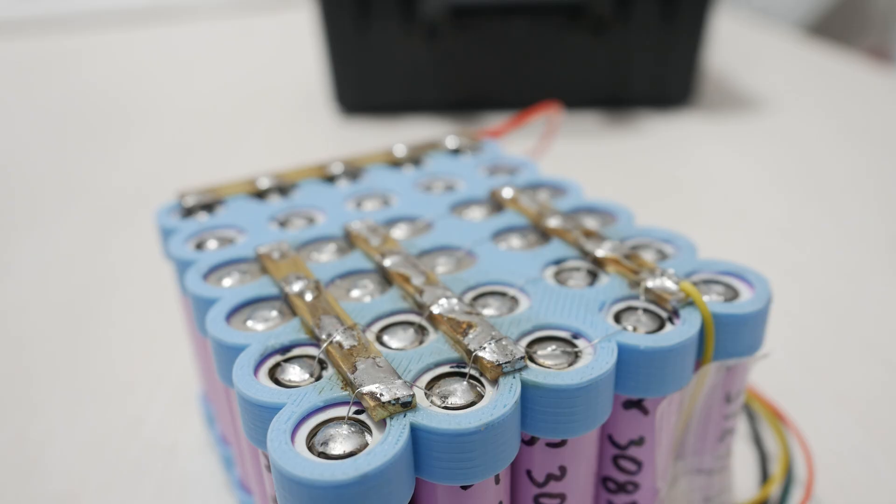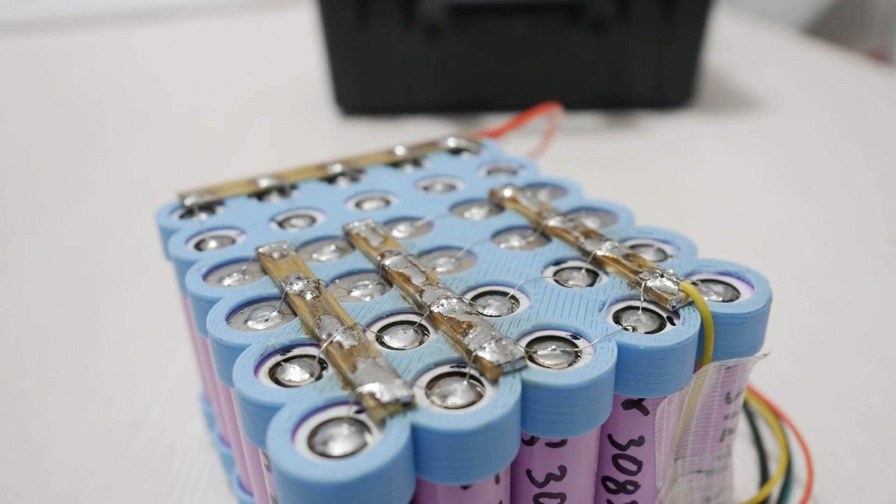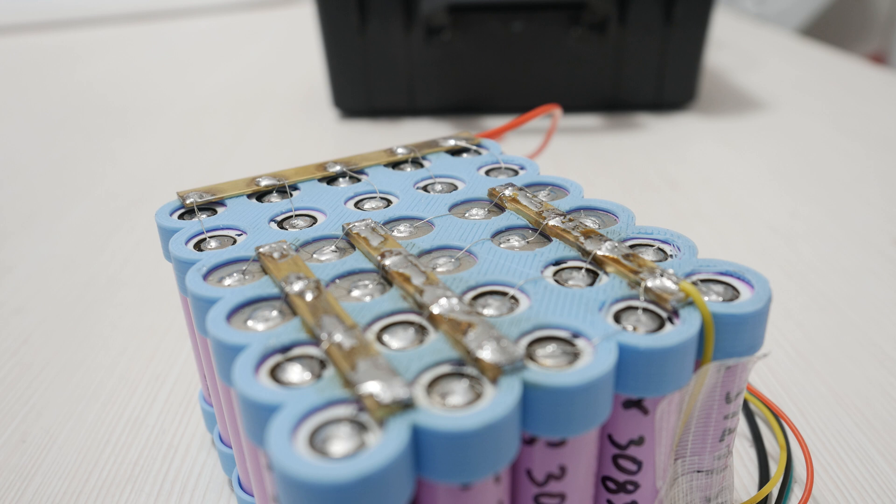The cells are connected with fuse wire to brass bus bars, so they should be able to take a pretty sizable load and not complain much. Also, the fuse wire is going to burn out if a cell has an issue, which provides a safety mechanism.